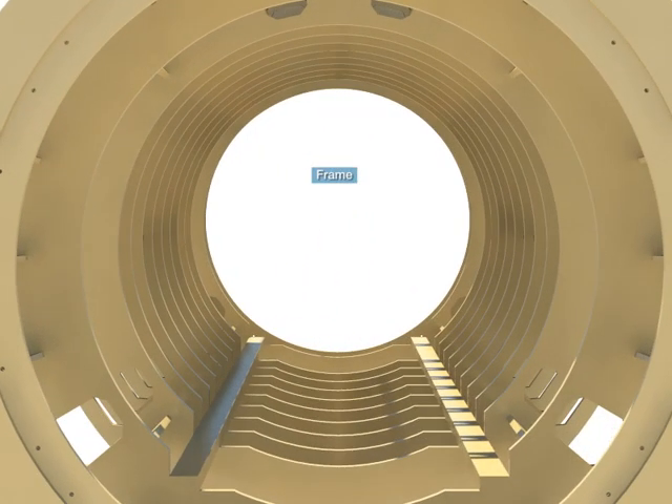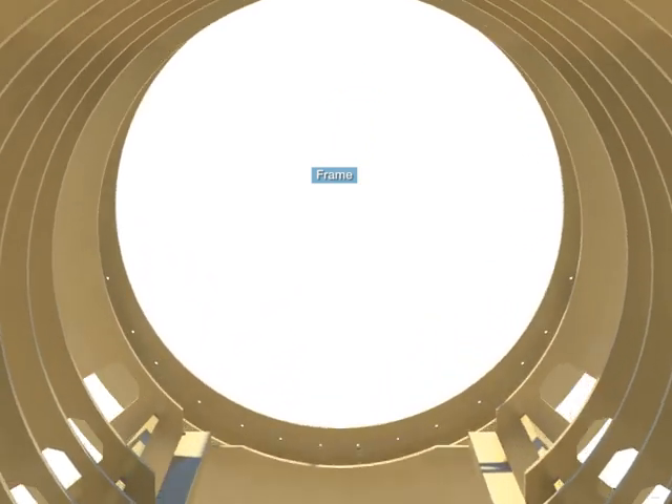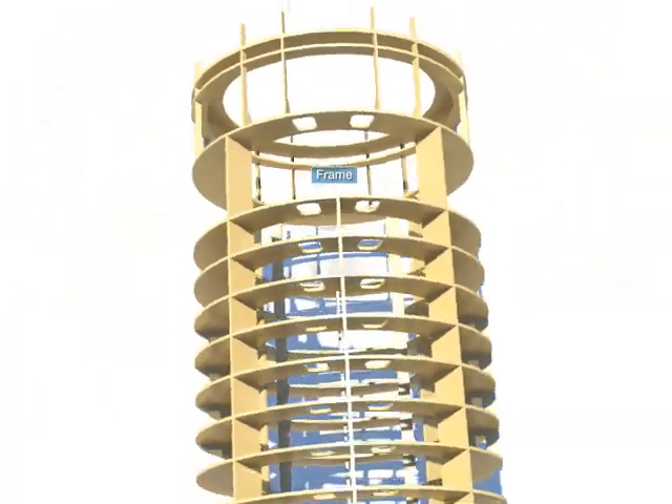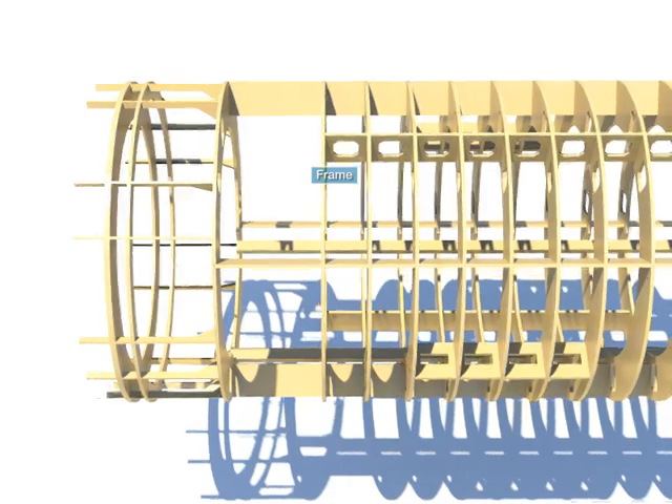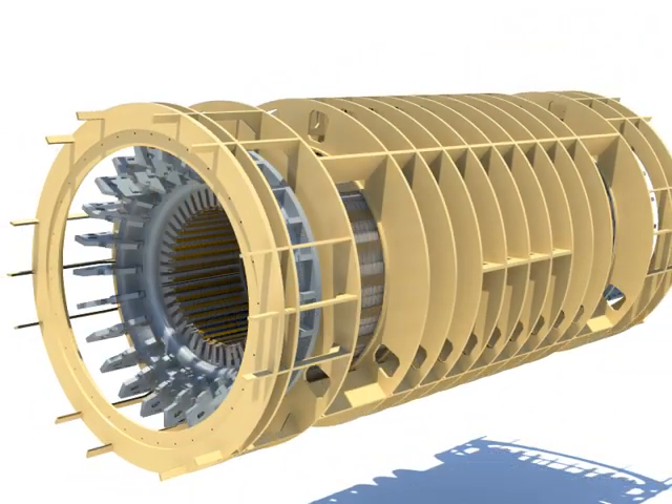The frame is a cylindrical structure supporting the stator structure, bearing stand, and the hydrogen cooler, which works as an attached device supporter, sealing hydrogen gas, constructing airway, and preventing torsion.